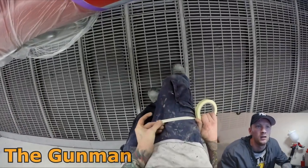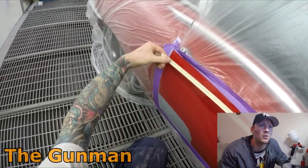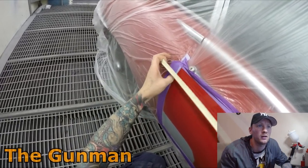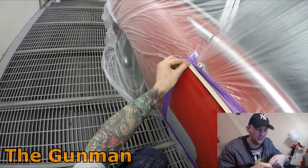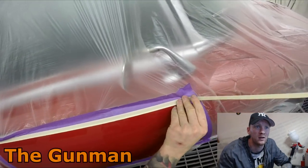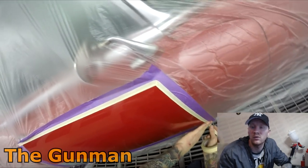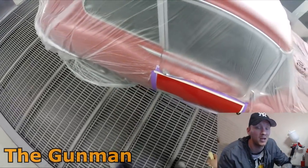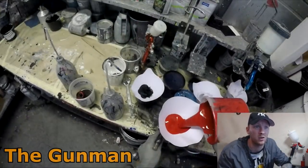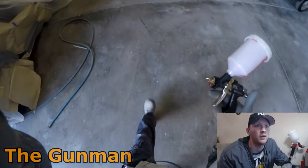Just before you paint, make sure you tack cloth it down. I'm just using a bit of three-quarter inch tape to do one of my famous false edges — pretty handy little trick. You just flip that edge over and roll it out. I've got a couple of videos that go into more detail if you're struggling to get that false edge, but it's very handy — I use it daily. It'll be a rare day at work that I don't use that false edge trick.